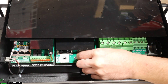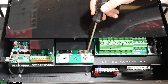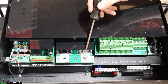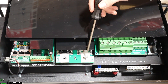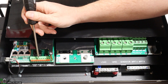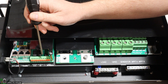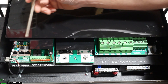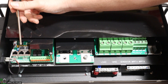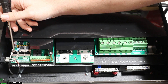If you move over here, you've got your battery negative and battery positive — we'll definitely be using those. It's got a screw terminal designed to be used with an eyelet, and I think what I'm going to do is install a mechanical lug in here so my cables can just be slipped in and tightened down. Over here you've got different connections — for instance, generator start or generator communication — and some other connections I won't be using. You can also parallel inverters here, which allows you to use more than one inverter. And then this port here is the battery communication port.